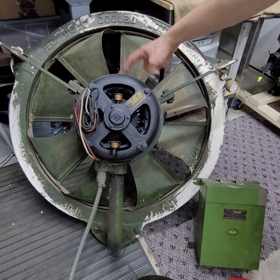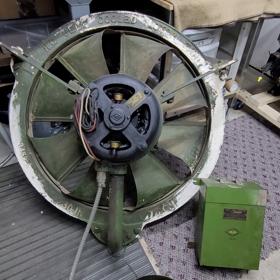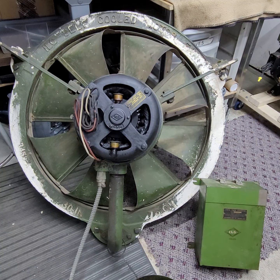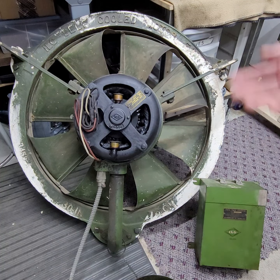The top of these motors — this one's rated at 110 volts. The blower motors that I have are rated for 220 volts three-phase. But the way they were wired when I got them, it looked like all the original wiring — they were originally wired so that they were in star or Y configuration at 220 volts. This one is wired in delta and it says 110 volt.